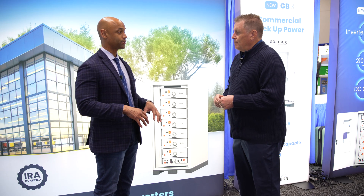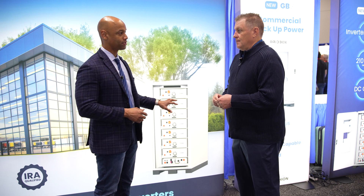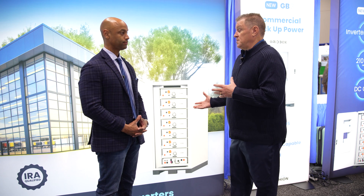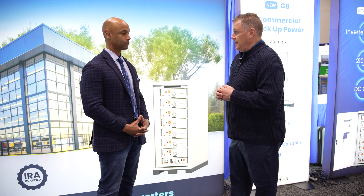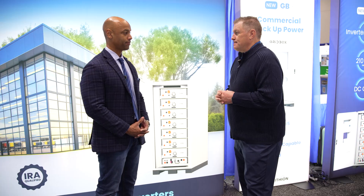Let's talk about those demand charges. Here we are in Southern California — if you're a manufacturing facility, you've got huge spikes in peak demand. Explain for viewers how you use the battery to levelize those peak demand charges. If your inverter supports it, basically you can have the inverter use the batteries during those demand peak times, and have the battery supply the power during those demand times. You can go over a 24-hour period and use the battery as your inverter will allow — controlling the demand fees by having the battery turn on when demand is high or during peak demand.